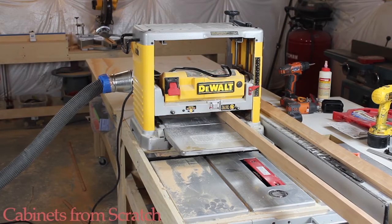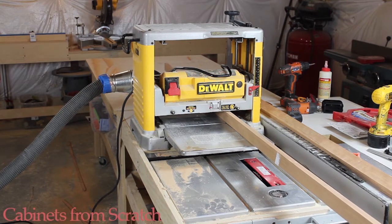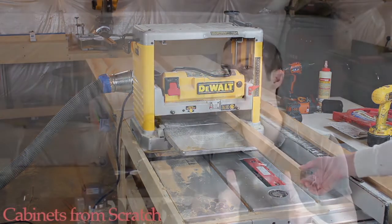If you were to do all that work and then lean the board against your garage wall for four months, you're basically wasting your time. I also use my thickness planer for cleaning up the edge of work pieces. For example, if you buy a piece of poplar that's a one-by-four — three-quarter inch by three and a half inches — and you want to make it two inches wide, you'd rip it down to about two and an eighth on the table saw, but that cut edge will be rough. You can stand the board on its clean edge and run the rough surface up through the thickness planer, which puts a new factory edge on that surface — basically resizing your board width to whatever dimension you want.